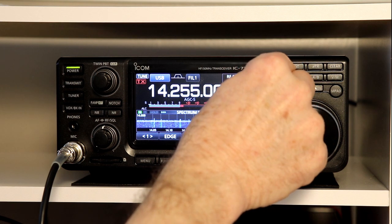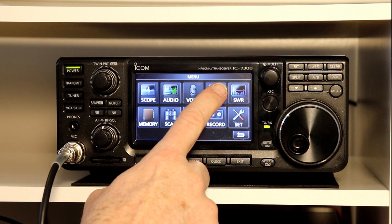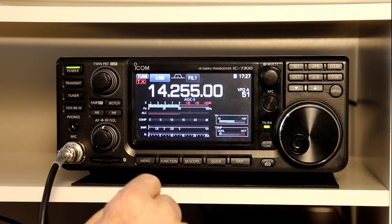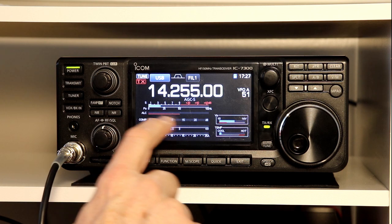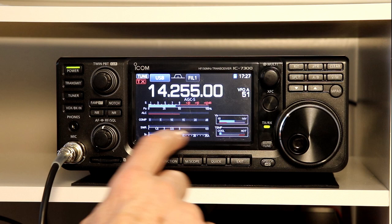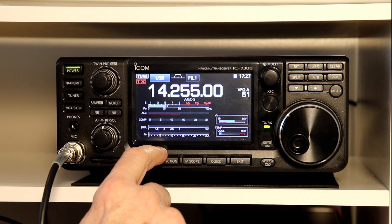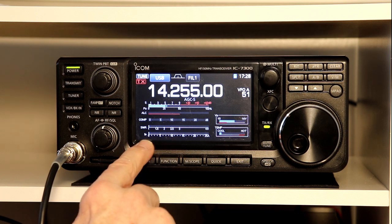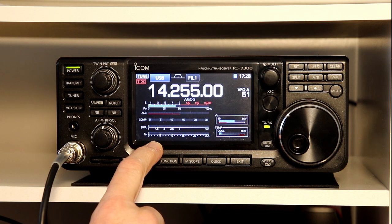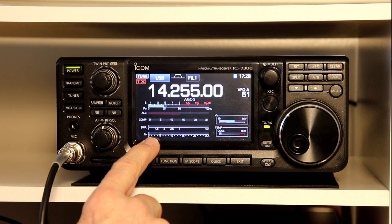You would just adjust that here as you're talking into the microphone. And then finally, we'll take a look at the meter. If you press the menu button and press meter, you now get all the meters at once. The top meter is your signal strength, and then it is power when you're in transmit mode. Then you have your ALC meter. The next meter is compression — how much compression is being done if you have that turned on, we'll get to that later. SWR for your transmit to show you how your antenna is doing or your tuner. And then ID, which stands for drain current. This is a solid state radio, so the output finals are FET transistors. The two input and output sides of those transistors are labeled drain and source, so this shows you how much current is going into the final transistors.